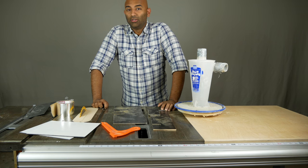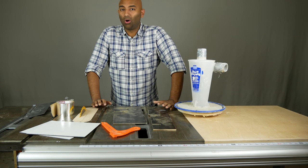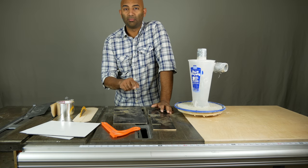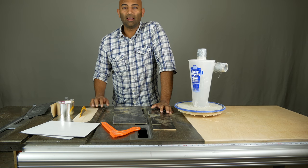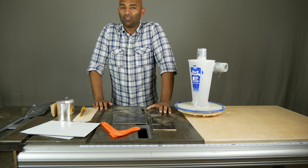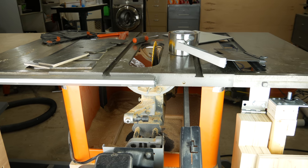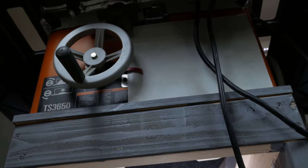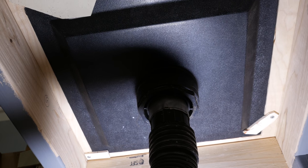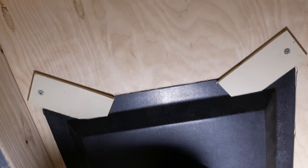The next thing you're going to want to do is seal off the bottom. I had a totally wide open bottom on my saw, which is where all the dust escaped from. When I built my new platform, I put a new piece of plywood cut in the shape of a template that I had bought — a 14-inch dust collection chute for table saws. To make that fit, I routed out the bottom and added these little tabs. If I ever needed to service the table saw, I could take the insert out and access the bottom. When done, I can stick the entire dust port back on and close it all up with the holding bracket.